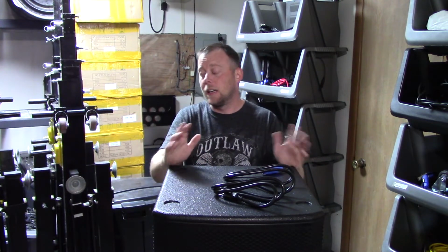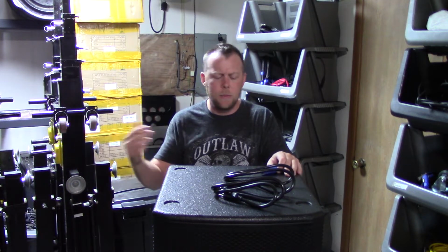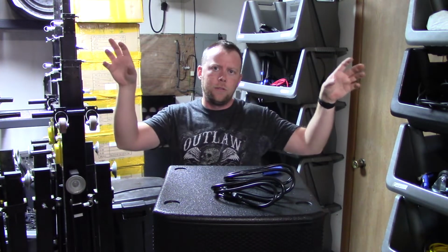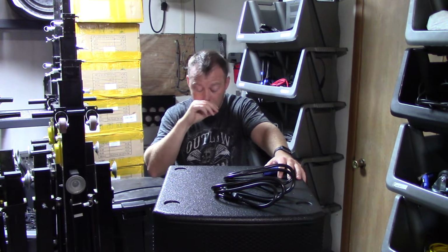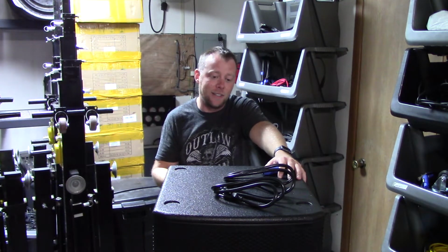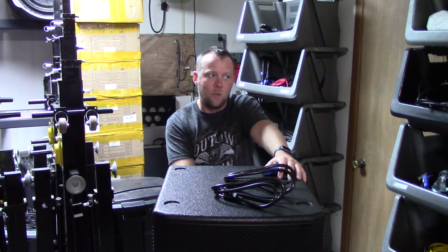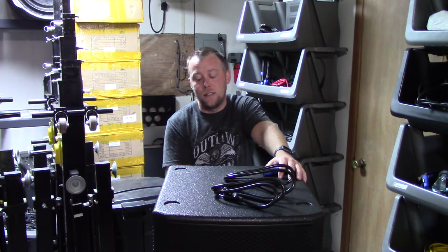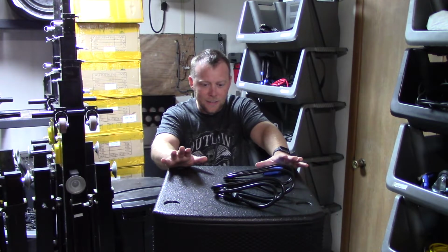I initially had looked at getting the IP15B subwoofer, where you have the ability to do the 2 satellite speakers. It's got a 3-channel amp in it. But I did not go with that because in the specs on that one, it was clear to see that the output A and B XLRs were pre-processing, and the crossover processing was all in the Speakon output for the satellite speaker. So I went with this one.